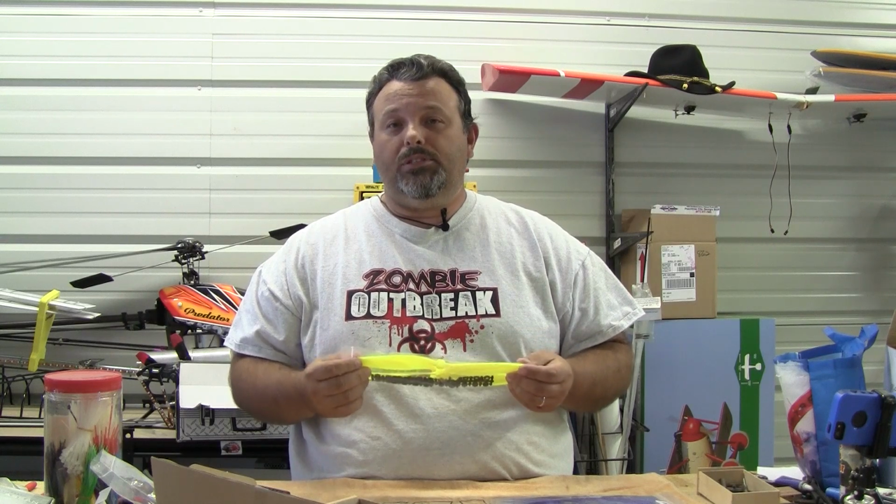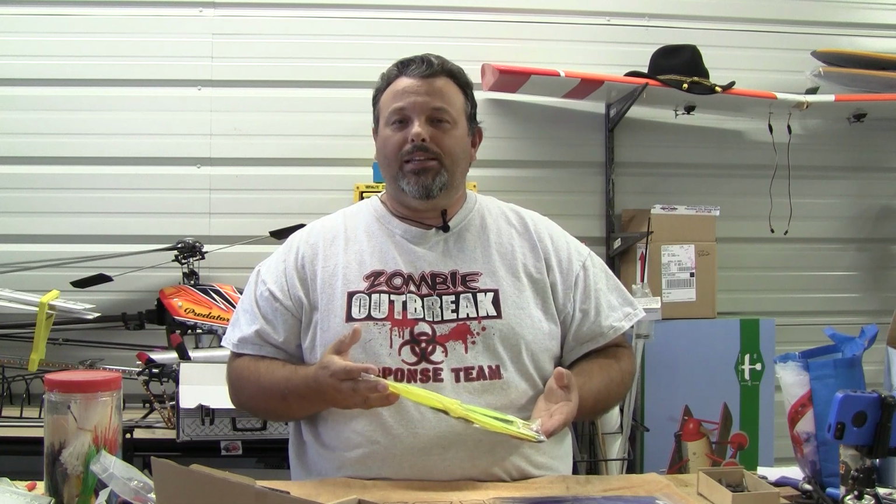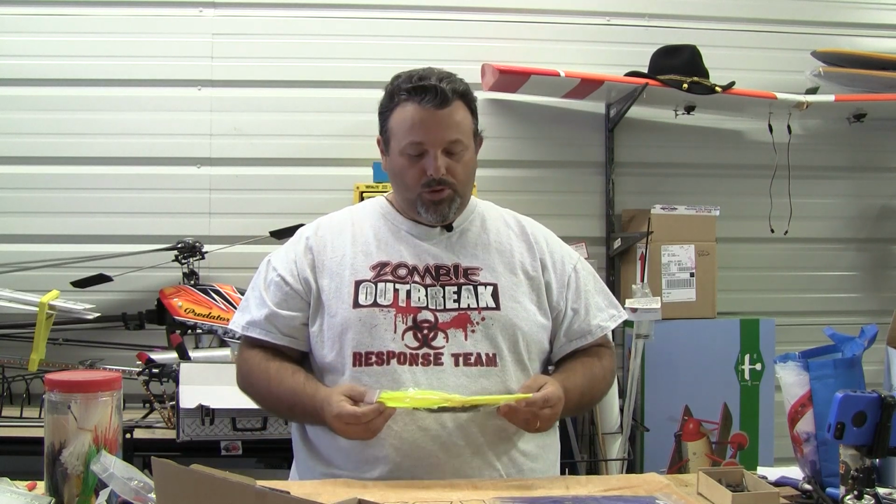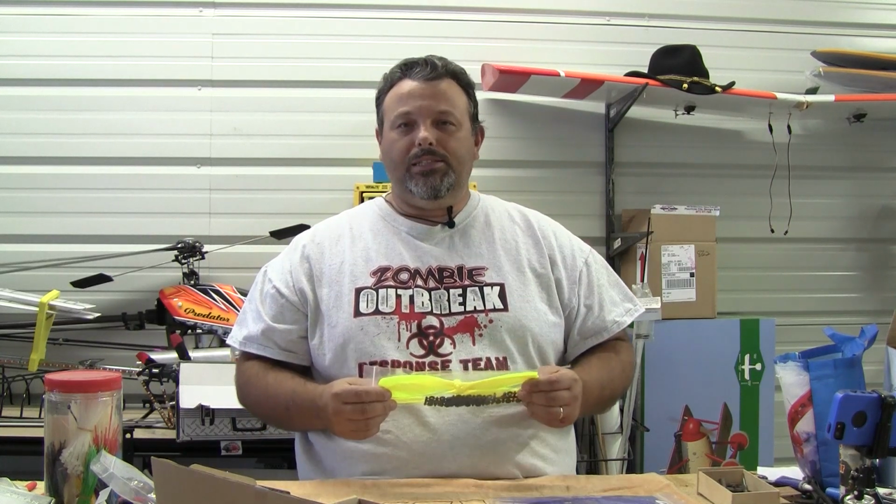So we are using the 10-inch propellers versus the 9-inch propellers that I used on the Quadcopter to start with. I ended up going to the 10-inch propellers, and it gave me a lot more power. So I'm going to try the 10s first, but I could go back to the 9s since this is not really going to be lifting anything. It could get us some longer flight time with enough power to still do aerobatics. So I'll try them both, let you know which one, but I think I'm probably going to like these 10-inch propellers. So we'll go from there and we'll see.